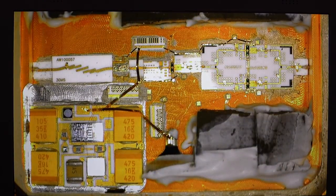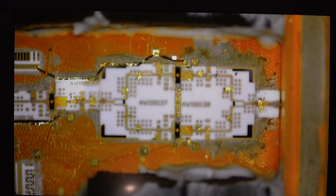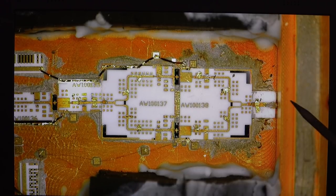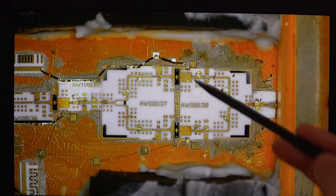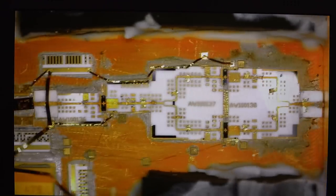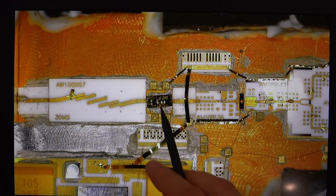Zooming in for a close analysis: this is our first input amplifier — a pre-amplifier stage. You can see a signal coming over here, splitting into a power divider, then two amplifiers, then combining back again — a power combining amplifier, a very classic architecture. The output then goes forward to another amplifying stage after a few matching components, then continues to another dedicated ASIC as the final power amplifier of this chain. There's a filter at the output directly to the pin — these have K connectors, so this is a very high frequency amplifier, going up to about 20 or 30 gigahertz.